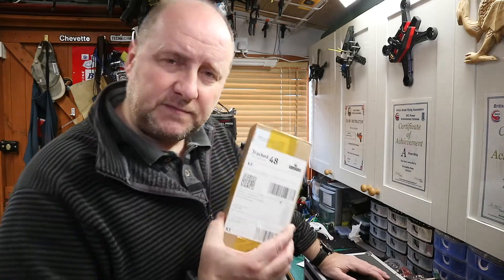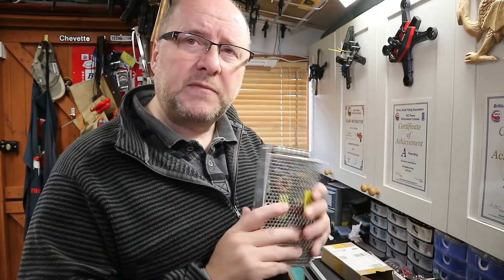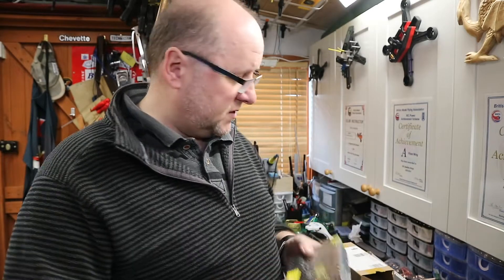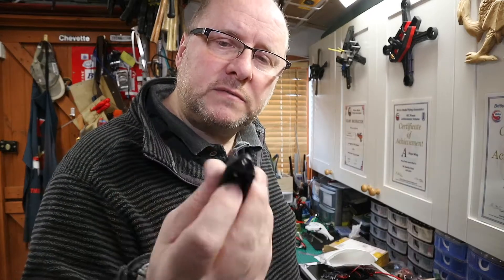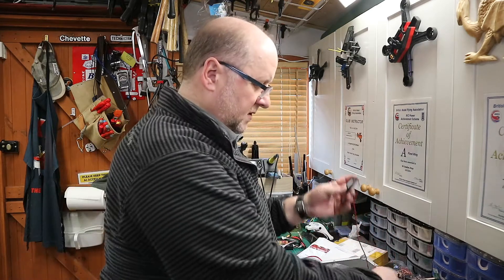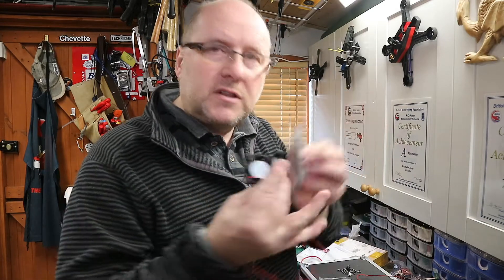Batteries are flat, batteries are knackered, they're kaput no more. To keep this box going, I bought one of these - this is a 16.7 amp 12 volt power supply, and this was about a tenner. I'll put a link below. Basically I can put 240 volts in and 12 volts out. I'm going to put an IEC socket on the outside so I can plug in the mains, and because that power supply needs cooling, I bought some 12 volt cooling fans and some nice grills. So I'm going to put the power supply on the inside of the box that will be capable of running the charger.